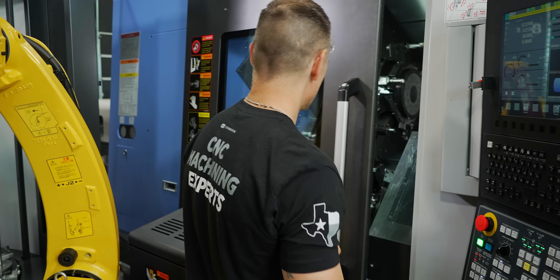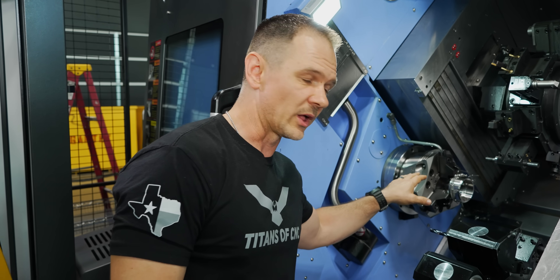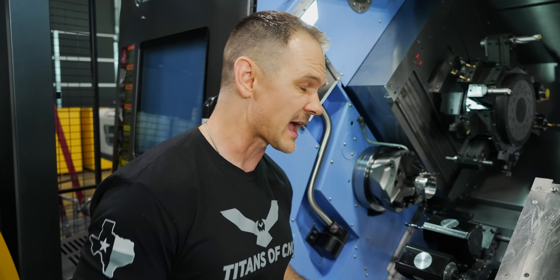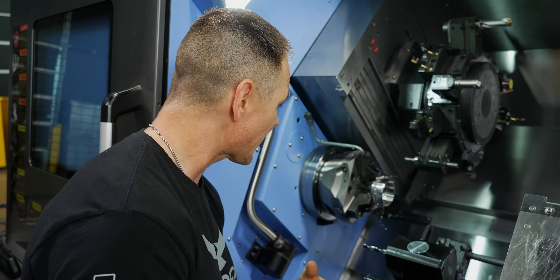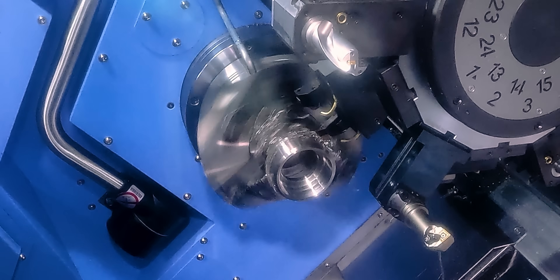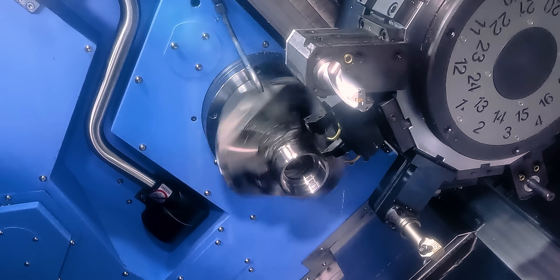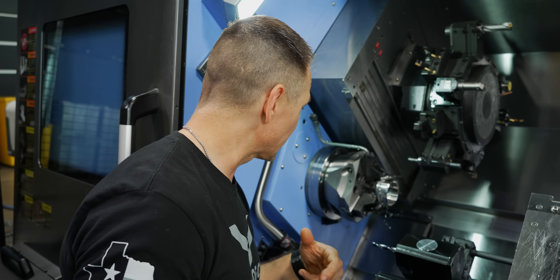I want to stop and discuss a couple of things to help you be successful when implementing a system like this. If you want this robot to run well, you really need things in here to run well. It doesn't take much — if you get a couple of chips embedded in your jaw, you could come back after 50 parts to find 50 scrap parts. Right here we have a classic example of chips wrapped around the part. I'm going to use another tool to pull that off so it won't be a problem during the chuck transfer or robot grab.